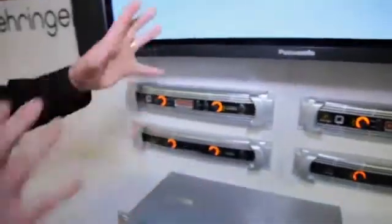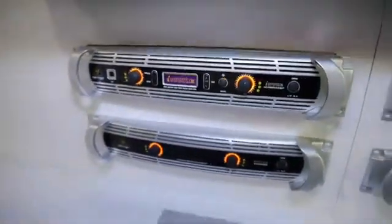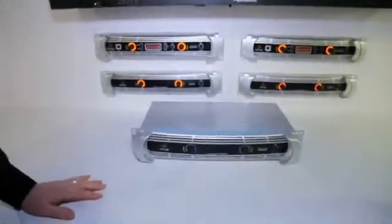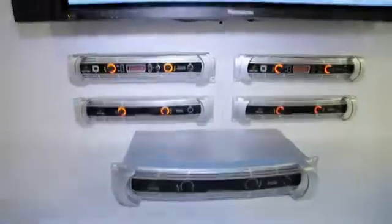You just come into it, cross your signal over, and decide where you're going to feed that signal to. You also have built-in limiting, so if you're worried about protecting your speakers, right in your power amps you can add a limiter and not blow any of your drivers. There's also a parametric EQ in there — it's all under DSP control.